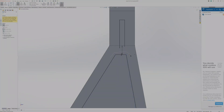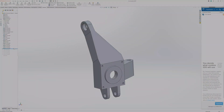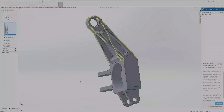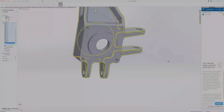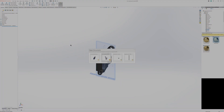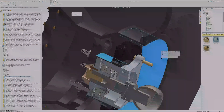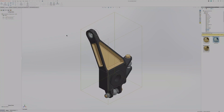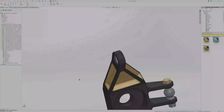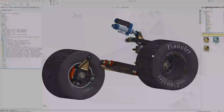Now that I'm confident with the steering location, I need to finalize the design for the spindle upright and put in some pocket cutouts. These are not purely aesthetic — adding pocket cutouts makes the part more rigid as well as more lightweight. Adding chamfers and radiuses gets rid of stress concentrations, because anytime you have a sharp edge all the stress stays concentrated in that sharp corner. You want to reduce those as much as possible using fillets and chamfers, and it also makes the part actually machinable, especially with weird crazy angles like this.